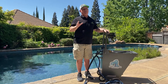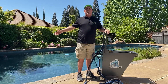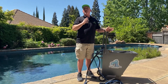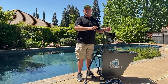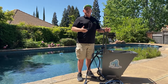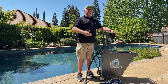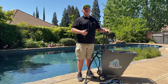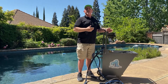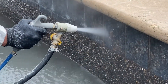The biggest benefit when it comes to media is that you already have to get the media out of the pool. With a dry blast system or wet blast pot, you've got to put it back into that pot — and with a dry blast system, you can't reuse that media. But when you suck the media out of a pool after using the Pool Master and it's drained of water, that media will go through the nozzle eight to 15 times before it's no good. You pour the media back in the tank, take it to the next job, fill it back up with water, plug the pump in, put it in the solution, and you're reusing the media.